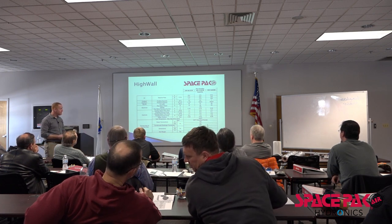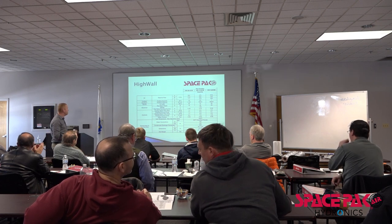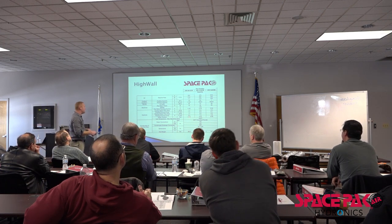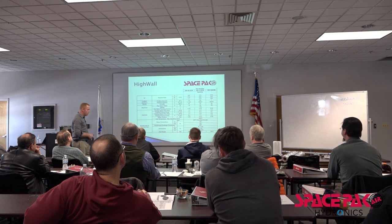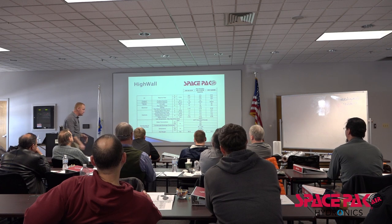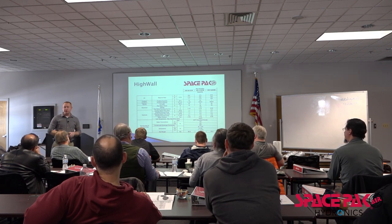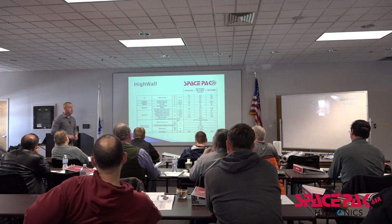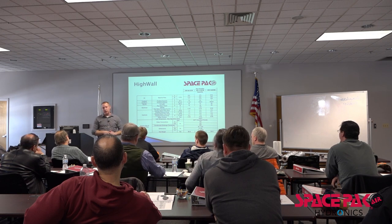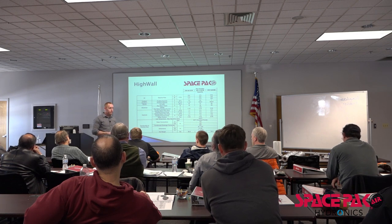Our maximum operating temperature on these things is 160 degrees. Right? We wouldn't want to go any more than that. You can see, right, the devil's in the details. GPM. One of the things to remember, always remember, like your name, you want to remember this. If I'm going to heat, my design temperature to heat with is 120 degrees. Something happens, air filters get plugged, I don't know what's going on, and the water temperature delivering is 120. You're going to still heat that room, and it'll just take longer, right?